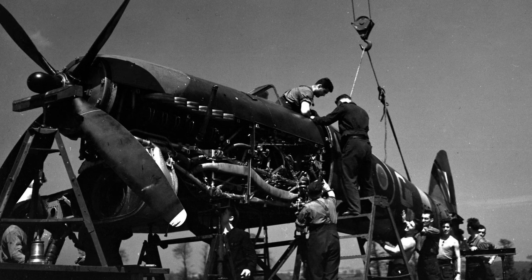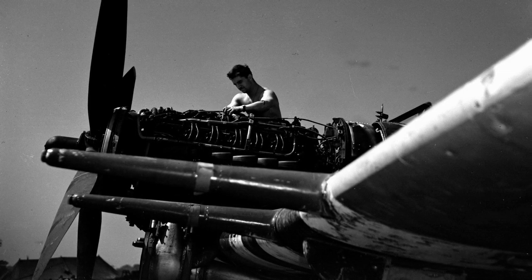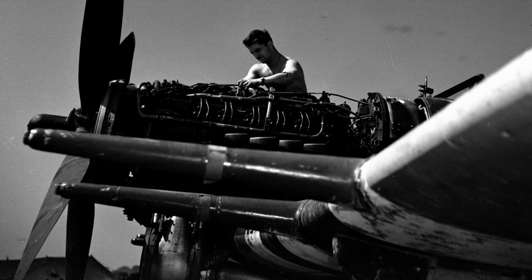After years of looking at the structure and design of the Hawker Typhoon, it's clear that they set out with two main design goals. The first being ease of maintenance — they kept the tube structure not just because it was tried and proven, but because it was maintainable. You could remove one tube and bolt a new one on with no cutting or welding, and it could be done fairly quickly. It also allowed the Typhoon to have completely removable cowl panels from the cockpit forward to the nose cone, giving immediate access to the engine and systems.